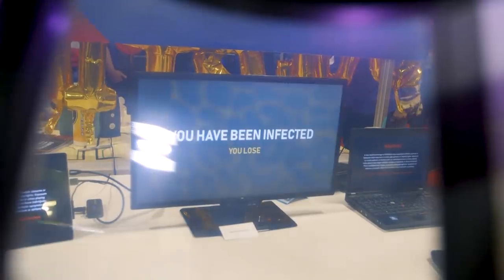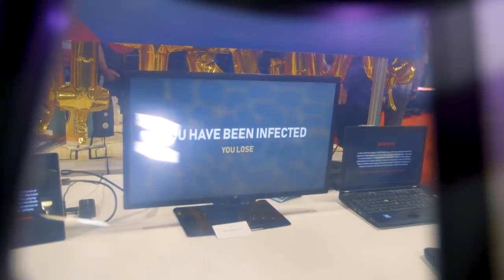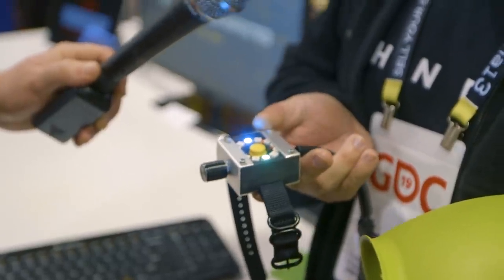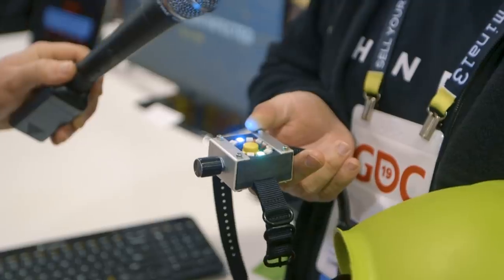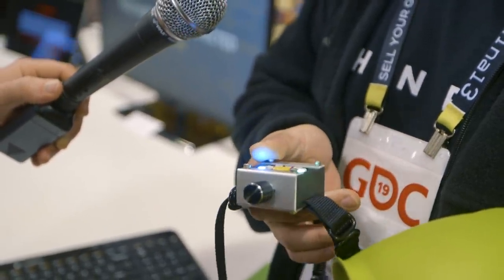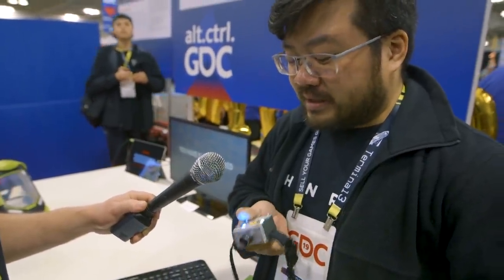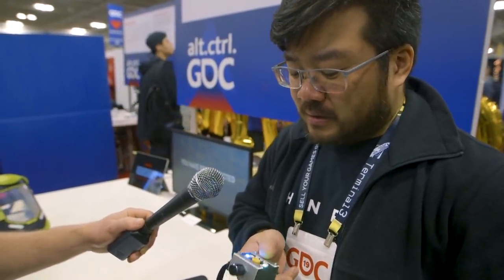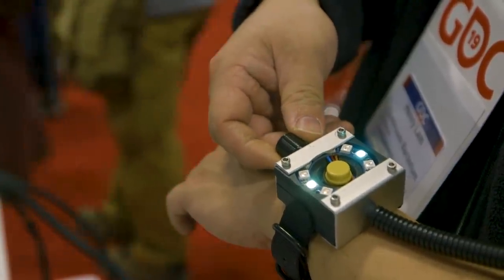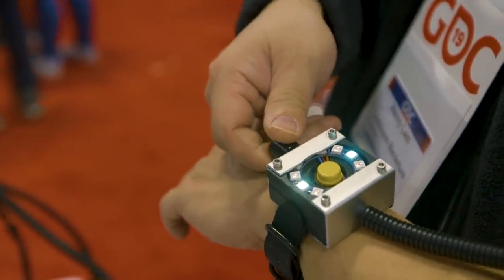This kind of gave me the opportunity to use both the helmet and the film at the same time. Walk me through what elements are in here. There are 12 NeoPixel LEDs — quite a lot of us who use addressable LEDs are familiar with these. It's really decorative right now, because I realized not many people are focusing on the watch when they're playing — they're looking at the screen, not down at their hands. It's definitely a decorative element to add some sparkle. The construction is aluminum square channel that was cut in half and used to bolt together four layers of quarter-inch plastic, individually cut and hollowed to create cavities for the different controls.